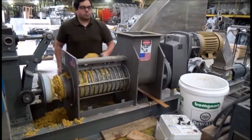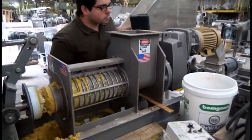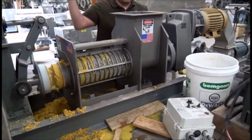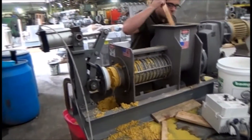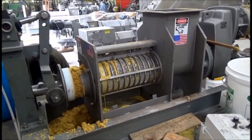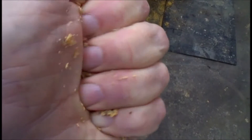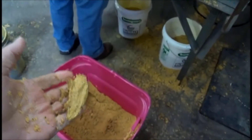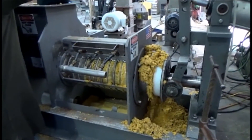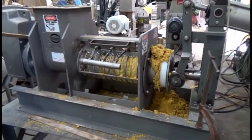This is Thursday morning. We're going to give this one last try. This is the DDG with the 5% cotton seed hulls. We'll see if getting them up to room temperature after sitting overnight does any good. We'll run the cone in at low air pressure, and if it starts working we'll crank up the air pressure. Here's the fist test on this material — you can't squeeze any liquid out with your hand or even get a blob between your fingers. I'm not getting a film out of this, so there's no moisture that a screw press can take out.